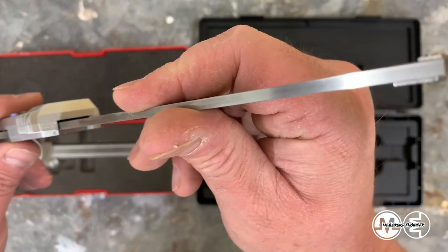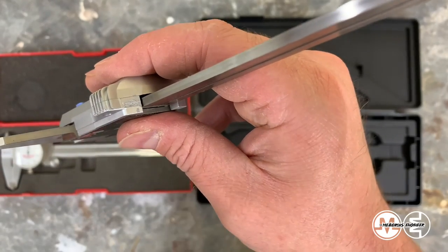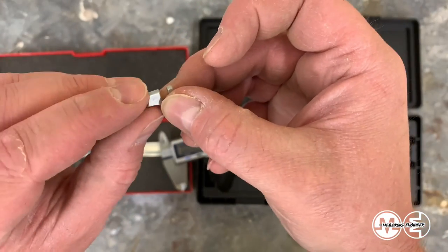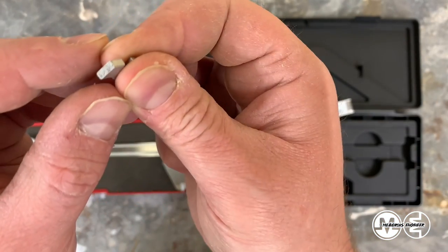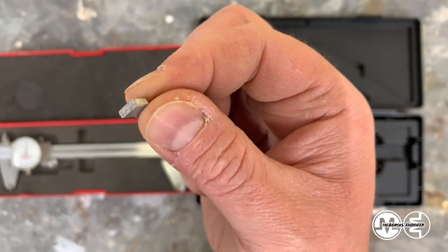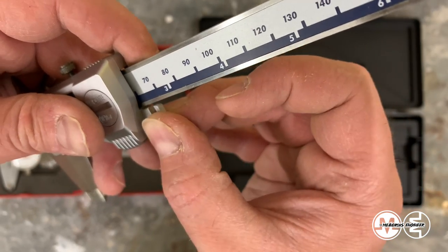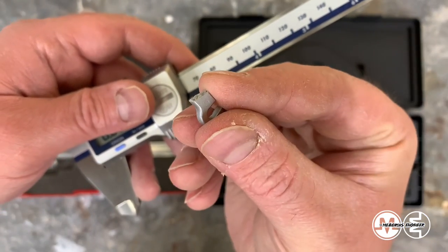And you can see up in here where the plastic has broken off, where this little hook is broken, and it's just straight plastic. It had a brittle fracture right here. And it just broke. I mean, even looking at this, the way it mates up, the sharp corners there, it's just born to break, in my opinion. Plastic, bad. Stress concentrations, bad.